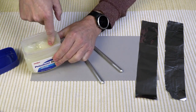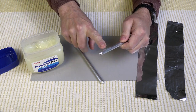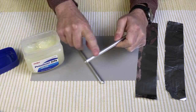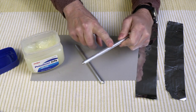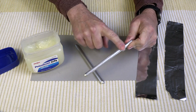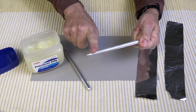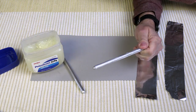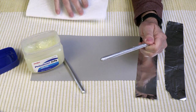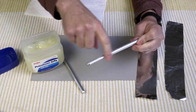Apply a generous coat of Vaseline on the mandrel because this is going to act like a liquid bearing and allow the foil to slide out from around it while it's under pressure. I'm making two mandrels here because I'm going to cast two separate cores. You're going to want to use paper towels — have a generous amount. It is a little bit messy, but make sure the Vaseline covers all of it evenly with a generous coat.